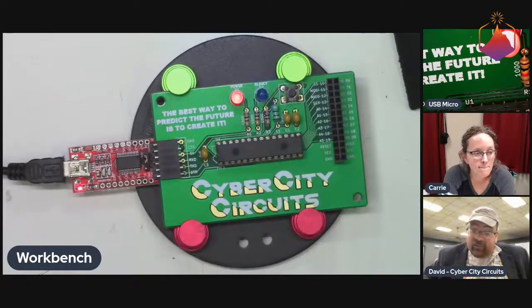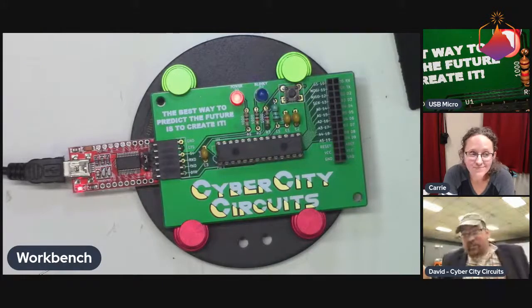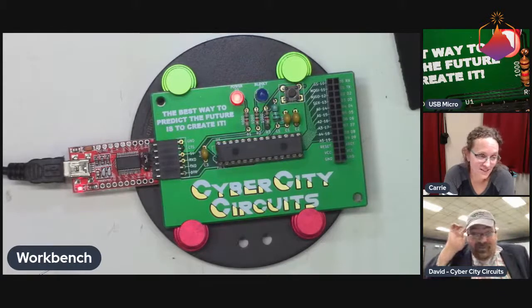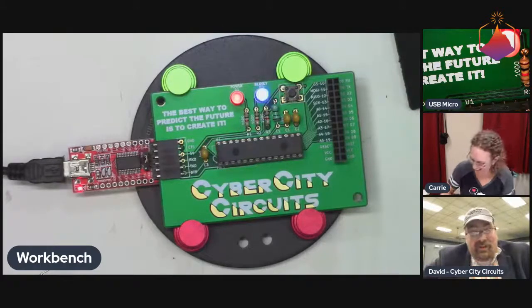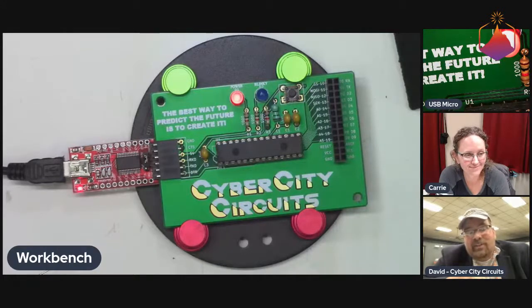Now, this is something interesting about making soldering kits that people might not think about. When you have a crystal on a microcontroller, you also need to have capacitors go along with it, right? Yep. In this case, you'd have a 16 megahertz crystal with 22 picofarad caps. Those caps look a lot like the other caps. Yes, those caps say 104, the other ones say 220. But if you get it wrong, that doesn't work. So you can't have two different kinds of caps in the same kit. If you were like me and didn't pay attention to the caps or what they were marked as while soldering, then you might have a rude awakening when your crystal doesn't oscillate.